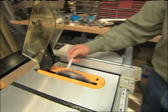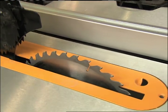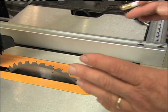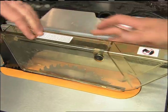The first thing you have to know about a table saw is the blade is always spinning toward you, and it's spinning fast. You want to make sure you keep your hands away from the blade, and you always have to be concerned about kickback. There is a guard that comes with the saw — you place it on there and your hands will stay away from the blade.